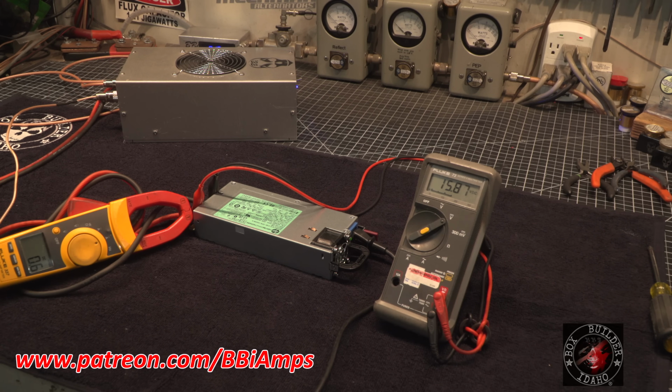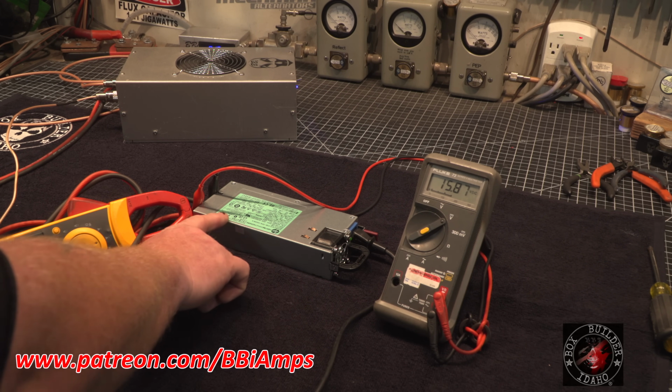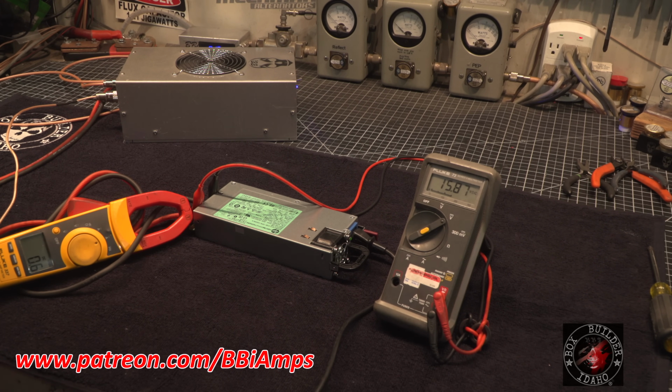The reason I got the voltage cranked that high, one, is to build confidence in the system myself, because we all know, once you go higher in voltage, you're going to sacrifice a little bit in amperage. I mean, really, the butter zone for this supply, in my opinion, is where we do the 12K resistor here, and we do the 39K on the crowbar protection. That's 14.8 or 14.5 to like 14.9.